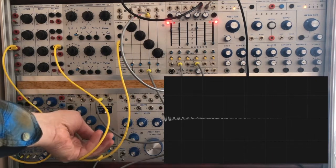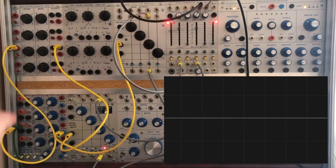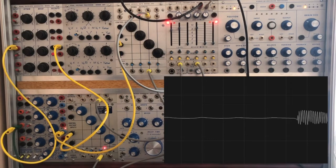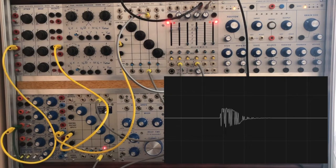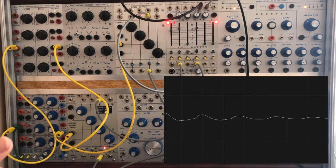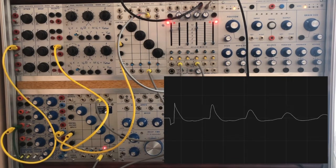And so let's put it in low pass filter mode and compare those two. B controlled by the 281, and C controlled by the 280 in filter mode. Now you notice that you do hear a volume increase when the 280 is controlling the 292C. And that must be because of that increased voltage level.